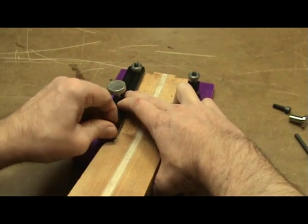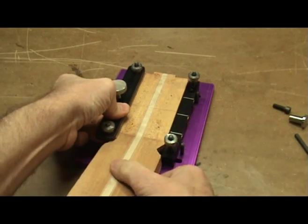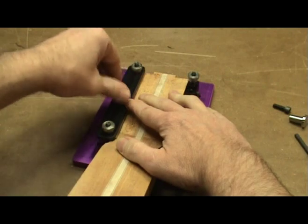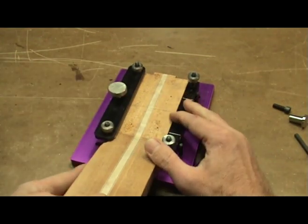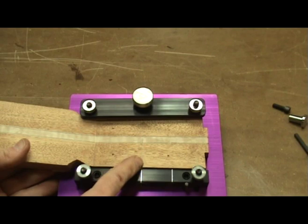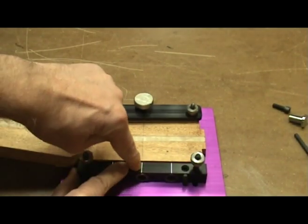As you tighten the screws, the other side of the peghead will lift slightly. When that happens, tighten the middle hold down screw. When placing the peghead into the jig, make sure that the center line that you marked indicating the position of your tuners is aligned with the same line on the jig.